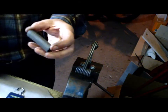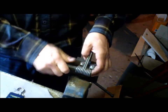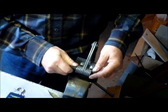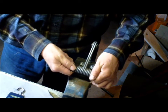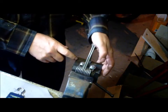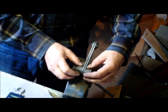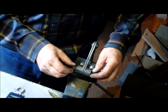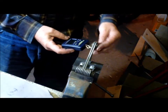A piece of hose, 65 millimeters long — it's a tight fit. Stick it up in the middle of the spring; it's a little longer than the spring. What happens is, because the spring curls around itself, it tends to contract like a constrictor. This rubber will work against that contraction.